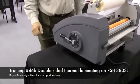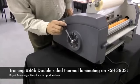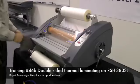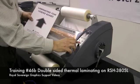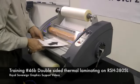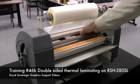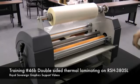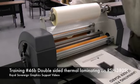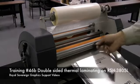Drop our safety cover. We want to make sure that our laminator right now is in the open — the rollers are open. We want to bring it to the lamination mode so the two rollers are together. Take our leaderboard, hit run on the laminator, and we're going to pull the film through the laminator. Make sure it goes between the two rollers in the back and out the other side, and trim your film off.